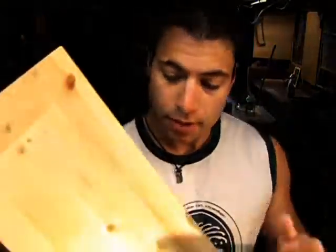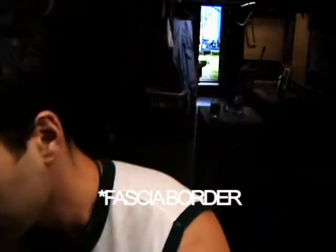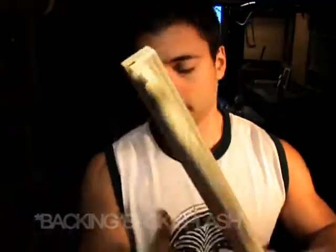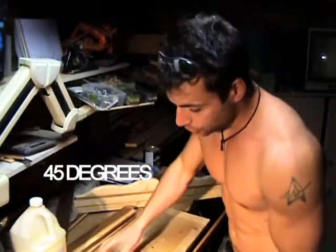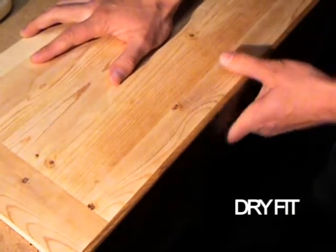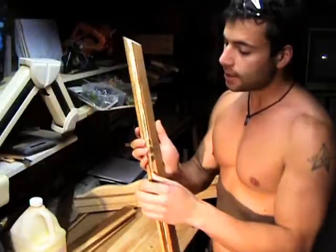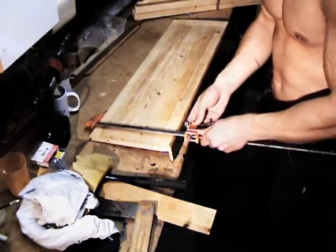Final step is here. All three main pieces are done. The top of the desk is where all the fascia pieces are ready to be glued and mitered. I cut the fascia pieces and mitered them at 45 degrees. Now I'm just going to do a dry fit to make sure everything lines up perfectly before I apply the glue — and it does. I'm not going to use any nails since I made a dado groove. Combined with the glue and clamps, it's going to be stronger than nails.